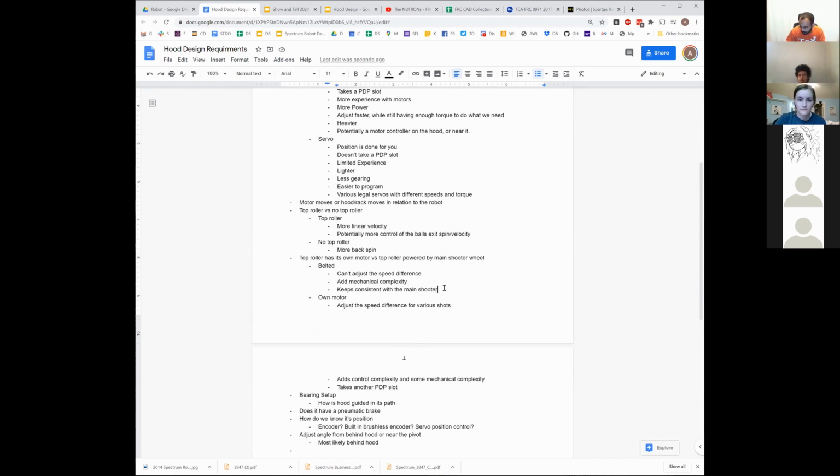That also depends on how much motor power you can put into it, right? If we can just get it up to speed every time the ball's through anyway, it just kind of works, right? And that's what we did this year: we had a heavy enough wheel. The Colsons were heavy enough that the Falcons were able to get back up to speed as each ball was coming through pretty reliably, which I think we can do again and not have to worry about as much mass on a flywheel if we don't have to. But that's something we could look at.